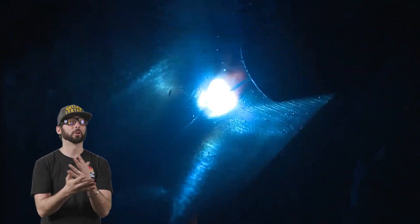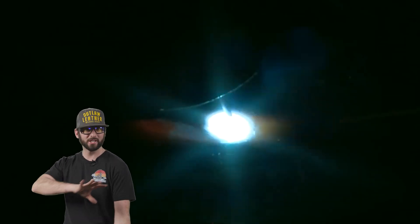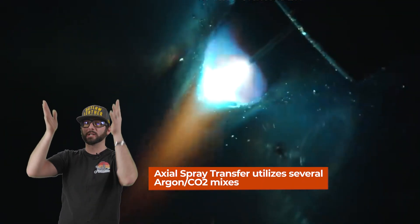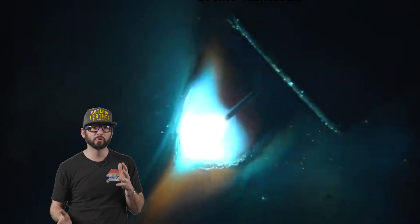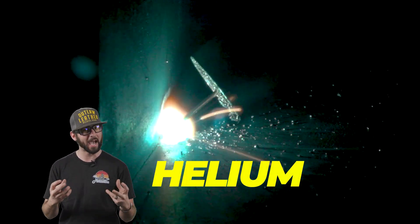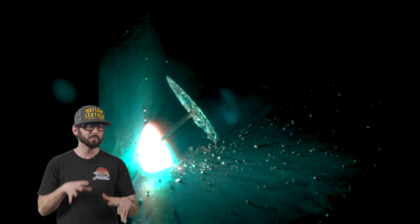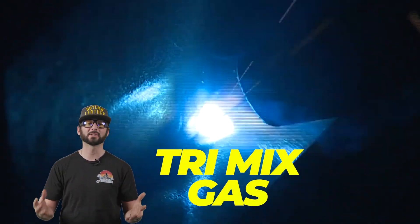75/25 and 100% CO2 are really common gases you can find at your local weld supply — CO2 is just a bit cheaper, but you get a lot more quality with 75/25. For stainless steel, you might use C2 gas: 98% argon and 2% CO2. If you change to spray transfer for really thick materials, you might adjust to 82/18 or similar ranges. You can even add a little helium to the mix for a much hotter puddle while keeping the same inert shielding characteristics — it burns way hotter with helium.